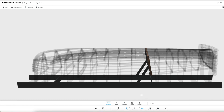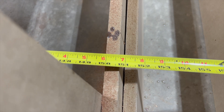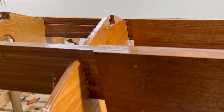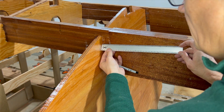Welcome back. In this video we'll be repositioning and notching frame 9 onto the stringer. From the 3D model we can see that frame 9 is mounted on the front side of rung 9, and if you measure from the back side of rung 9 to the front side of rung number 2, you measure in the model 152.5 inches. But on my strong back I actually positioned rung 9 1.75 inches too far forward, and hence bulkhead 9 does not meet up with the thick part of the stringers. Therefore I have to deviate from the plan. Up at the stringer I'm only an inch and a half off from the proper position.